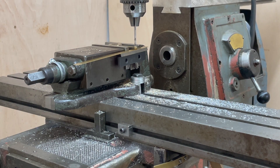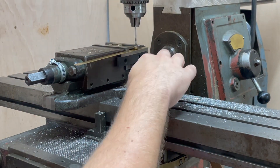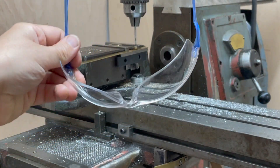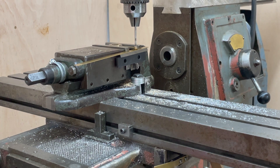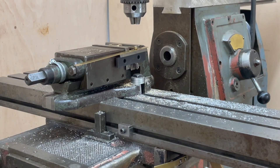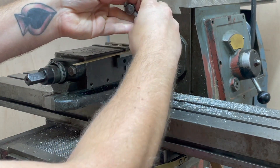This might look a little Heath Robinson — we've got a parallel, a piece of tool steel, and a strip of brass. Needless to say I'll be taking advantage of these. There's a little bit of resistance there, so let's see what happens. That seemed to work pretty well. So I'm going to drill that now 7BA clear. While I'm here I may as well countersink it.